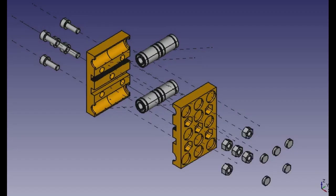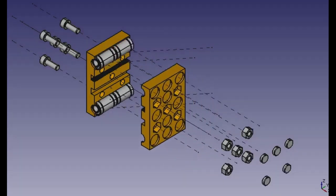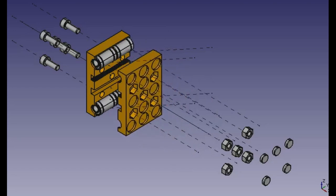To assemble the carriage axis, take one of the 3D printed halves of the carriage and place the four linear bearings inside it. Then enclose those bearings with the second printed part, making sure the belt teeth line up on both halves.